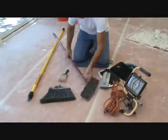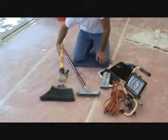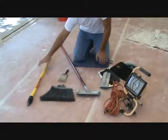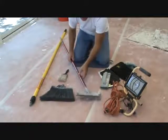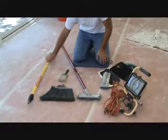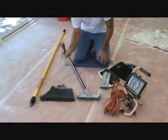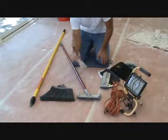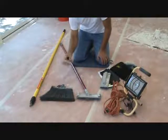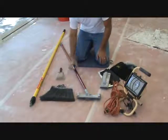Now, also we're going to need a broom after we get done sanding to wipe down the walls. If you have an extension pole, that could be handy to use for the higher bits so that you don't have to get on a ladder to sand the top parts. You get up there too high, and you don't want to strain your back, depending on how many walls you've got. Okay, so I've got an extension pole just in case I need it. I also have a paintbrush, and in the little areas around windows and stuff like that, after I get done sanding, I'll just use this as a little broom to sweep things off around light fixtures, electrical outlets, light switches, whatever I need. So it's always nice to have an old paintbrush handy.